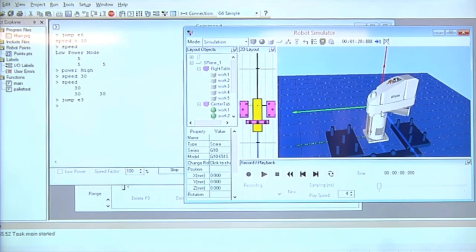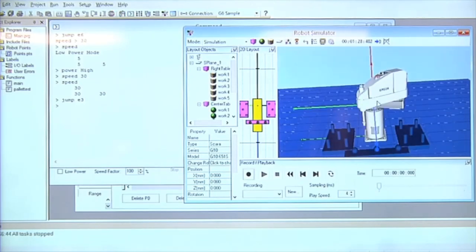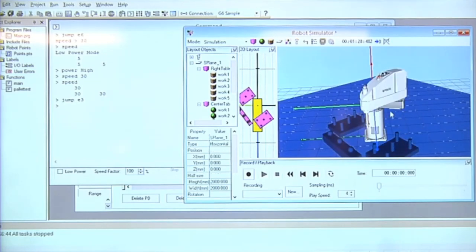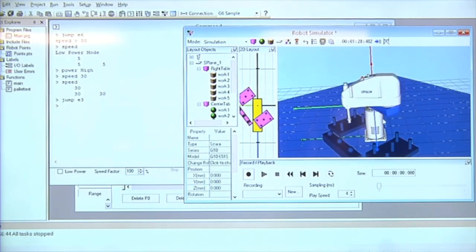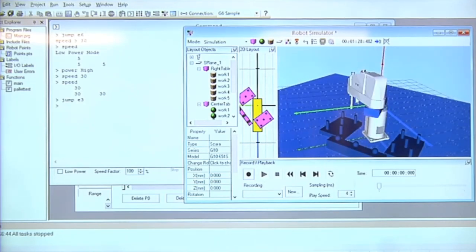But the key thing I wanted you to remember, and this is something that doesn't just pop out at you when you get it, is that to move my robot around in the simulator, you have to hit that control button on the left side. Hit the control, it highlights the Z, highlights the joint like here, like I'm doing right here, and then I get the robot to move. So again, I have to hit the control, then highlight the joint.